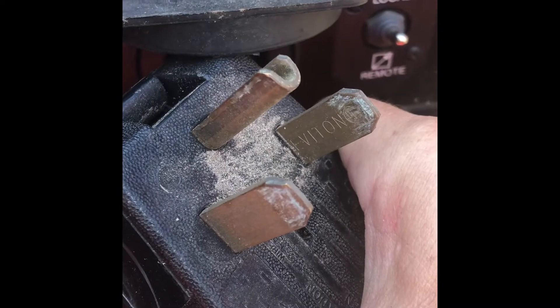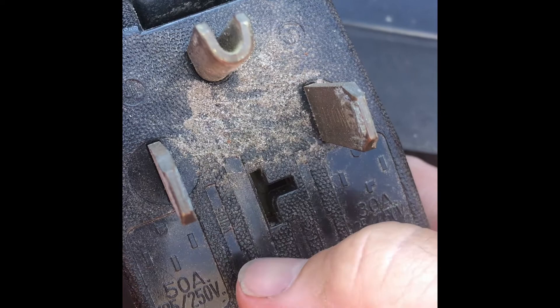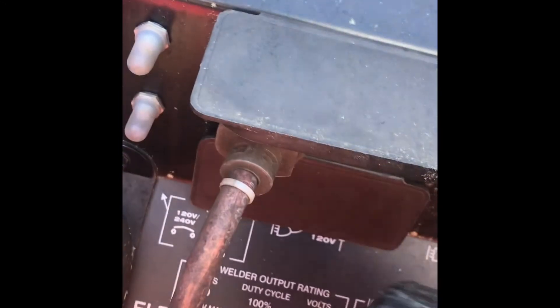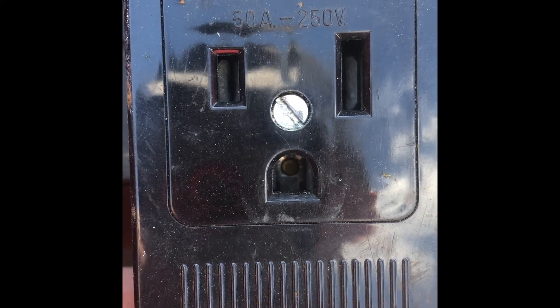So what you're going to have to do — what I had to do and what everybody does — is make a 3-pin plug from a 4-pin plug. As you can see, it's supposed to have this middle one in here. You can do that — you just pop it open and put your wires in there. So this has to insert in here like so. As you can see, it will slide in. On the other end, you're going to need your 3-wire, 3-pin connector set up just like the plug for your plasma cutter.